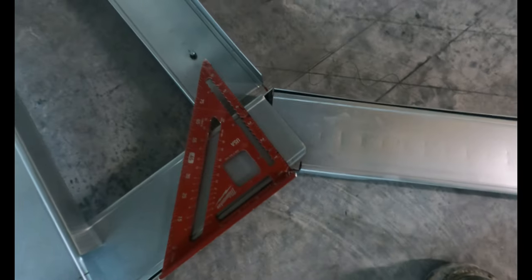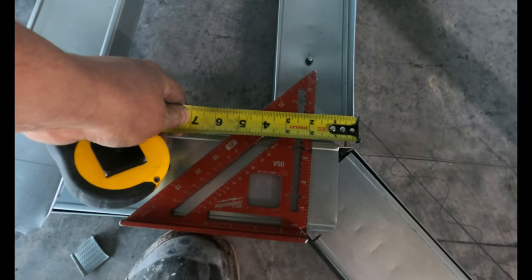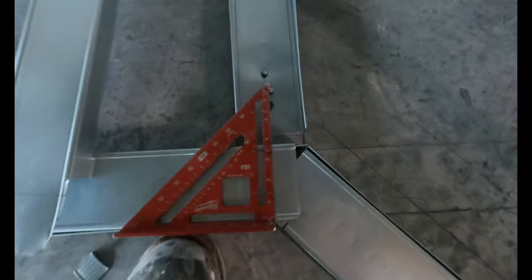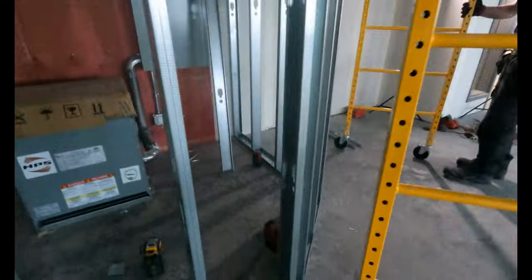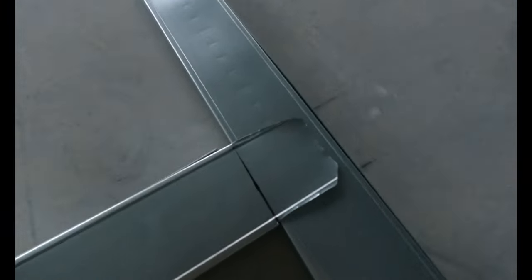This is a top track, so you can see on these angles — you put your square across, measure back, and you can see it's an inch and three-quarters. That's the tab for the front side to be cut. You measure the back, that's what you cut off the front for your tabs. You can also add an extra half inch for drywall to slip in. On this specific job the drywall will be finishing below the top of the wall.